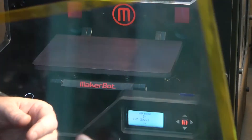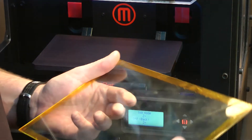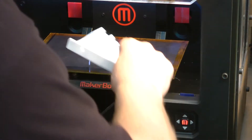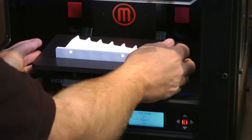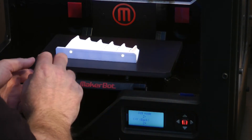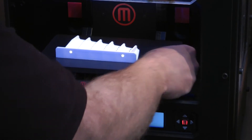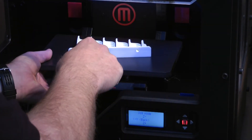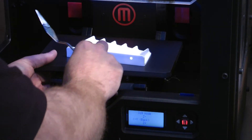The nicest thing about this, apart from being flat and allowing me to print stuff I wasn't able to do before, is simply being able to take it out of the machine. Because when something sticks like that on your aluminium plate — the standard setup — no matter how hard you try, you are twisting and flexing this whole carriage. And these are plastic. As soon as you put any sort of stress or tension or pressure on these to get your part off, even using a palette knife, there's no chance that build plate's going to be level afterwards.